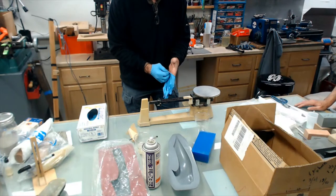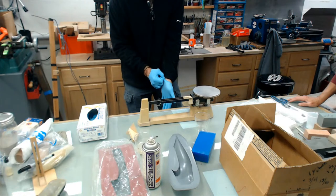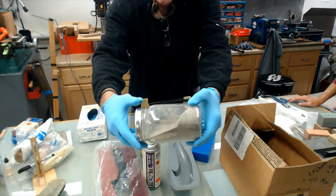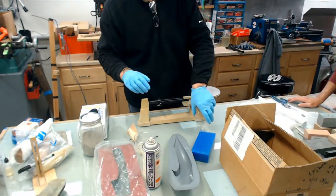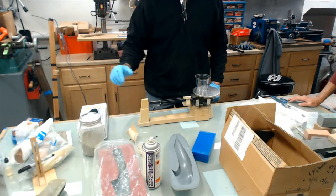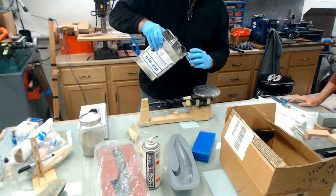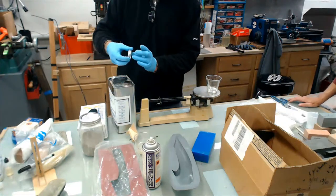The DT081, if you search it on Google, it'll come up, and it's on Freeman. It's the same website that John showed you for the tooling board. And it's still available. This is what it looks like. You've seen an hourglass, a bottle or hourglass. It's a really fine looking sand, but it's not sand, it's some kind of phenolic. So let's see, what do we have? 10.5 on the cup. Okay, throw some of this in there. It doesn't really matter what resin you use. This DT081 will fill just about any type of resin.